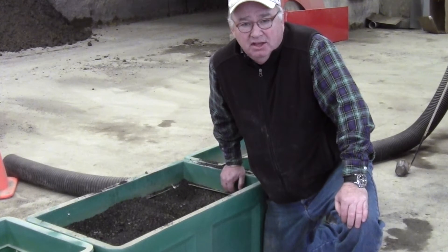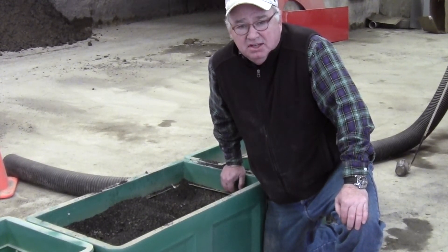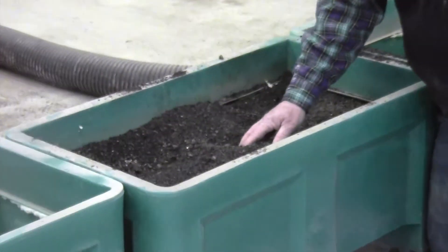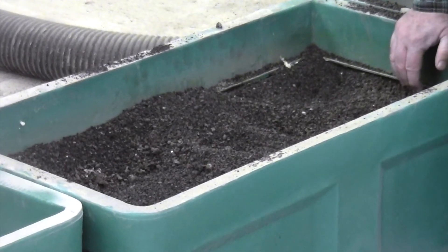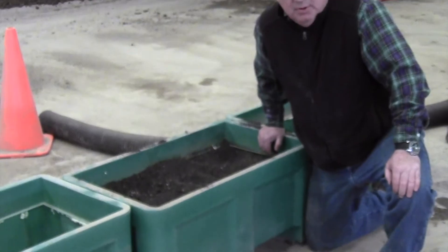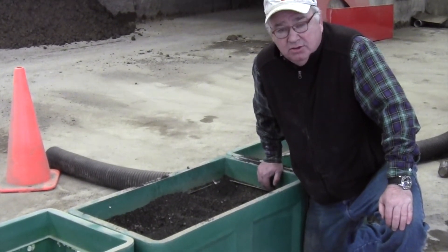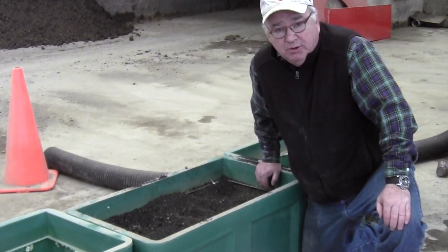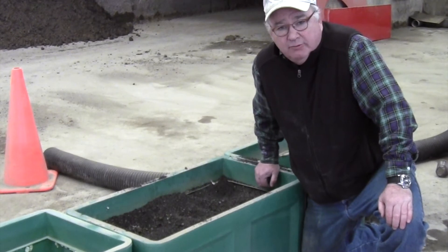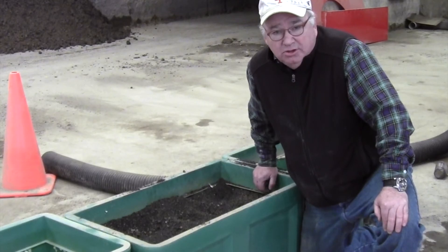I'm at the tail end of the infrared system. We have finished our processing — 25 minutes in the machine. We have taken 20% biosolids and turned them into 95% dry biosolids. All the pathogens are dead. You need to let it cool off a little bit after it comes out of the machine, but at this point you can bag it, you can sell it. You can use it on your football fields, your golf courses, whatever. This is a great product for grasses and fertilizing anywhere in your town.